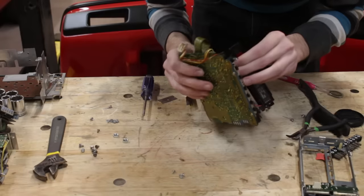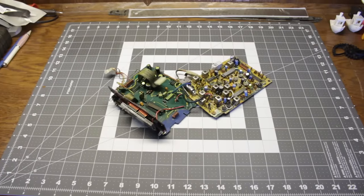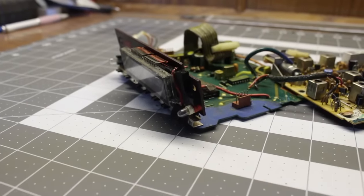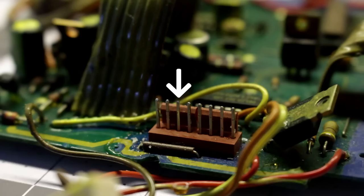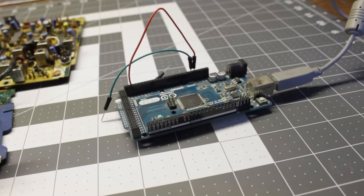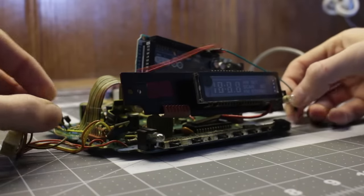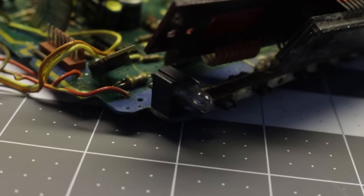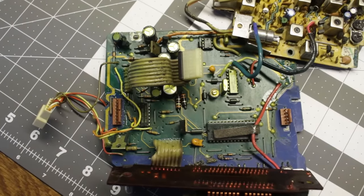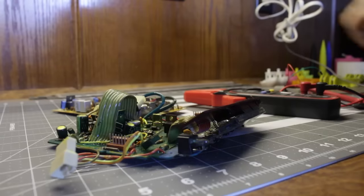The radio was popped out of the car and stripped completely apart yet again — for the last time, hopefully. Fixing what should be a pretty simple problem first, I want to tackle the little light bulb issue. The filament inside the bulb is perfectly intact, so it should be lighting up. I did a bit of electrical archaeology and found out that this pin here is the 12-volt input for the little lights that come on. With an Arduino acting as a baby power supply, we can test these lights out. But just like in the car, the right one is not coming on. 99% of tracking down electrical gremlins starts off with checking continuity, making sure that all wires and traces are allowing electricity to flow as intended. From the 12-volt input to the bad bulb, there's a trace that goes all the way around the board to this red wire, and that wire goes to the light bulb on the separate board for the display. With my multimeter set to continuity mode, everything checks out.